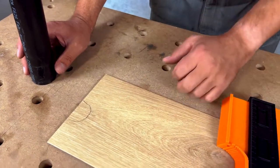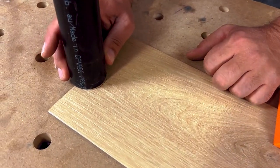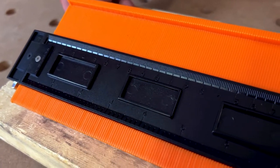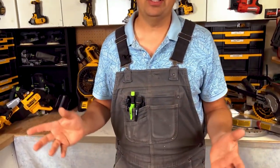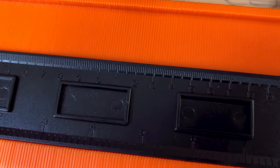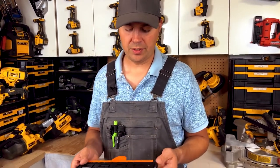Obviously that was real quick and dirty, but you get the idea. Now you can cut this out and it should fit perfectly. Contour gauges are super helpful — not only if you're just using it on ABS pipe or plumbing or whatever, but if you're going up against baseboard, you're doing some coping maybe, and you really want to transfer a profile from one thing to another.